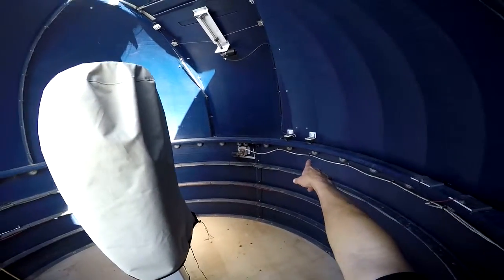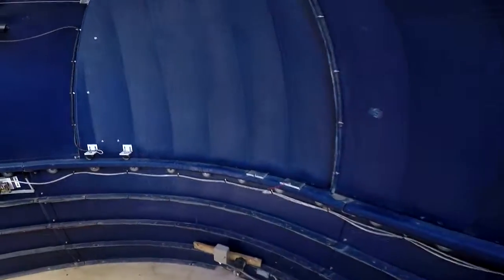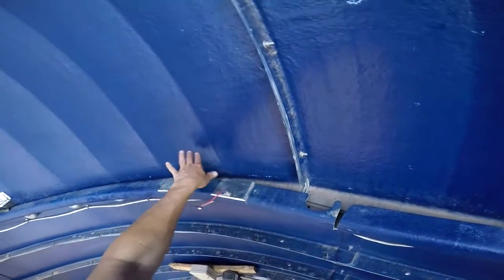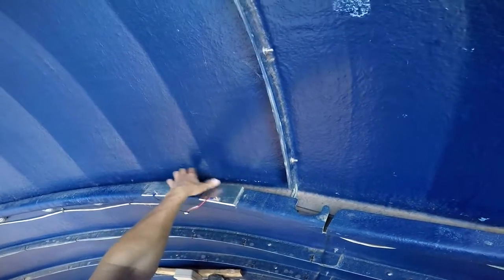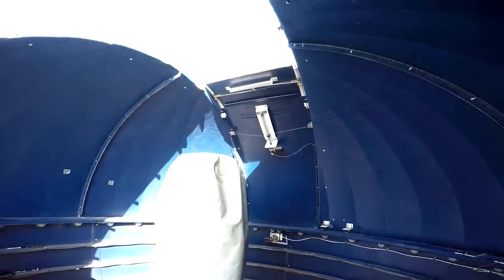As we mentioned earlier, you can see right now the contacts over there are off the plates, and there's the plates. So again, there's a little bit of dust on them. As they slide across, they should clean themselves a little bit. There is no danger right now of getting electrocuted. A, it's 12 volt. B, the only time power ever comes here is when I push that switch up or down on the shutter outside. So in the middle state, you're fine. That's it for right now.